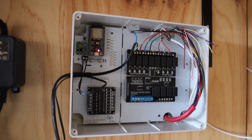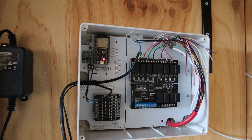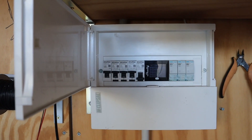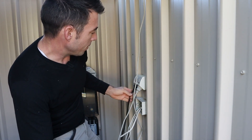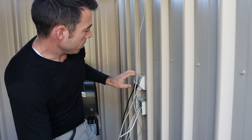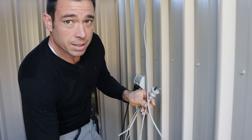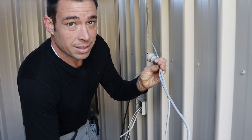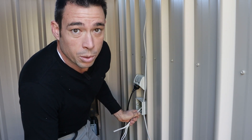I've just made use of some empty relays there and I'm powering them with 24 volts AC to turn those on and off. Now we're just going to finish off the last little bit outside — we've just got to hook up the switches for the pool light, the blower, and the lighting out the back. Out here with the pool equipment, you can see one of the power points that is switched from inside, running the pool filter on the pool circuit. That's got a large relay operating that power point because it's a heavier load running the pump. We've also got a light with a microwave sensor built in, connected to a lighting circuit to stay on all the time with the sensor operating it. We're adding two more switch circuits: one for the pool light and one for the pool blower.